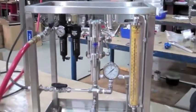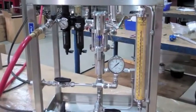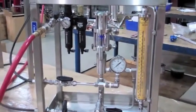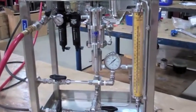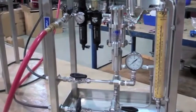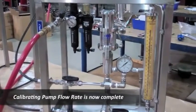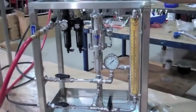Increase or decrease the speed of the pump depending on the flow rate required. Refill the gauge and retest to ensure the desired flow rate is achieved. Use the results from the calibration gauge and convert to flow rate per day. Calibrating pump flow rate is now complete. Close the calibration block valve and open the suction block valve.